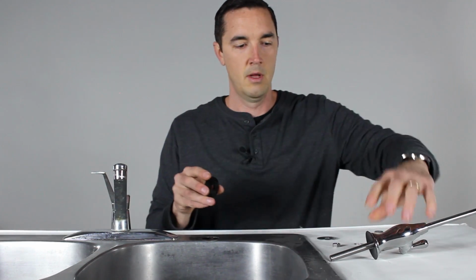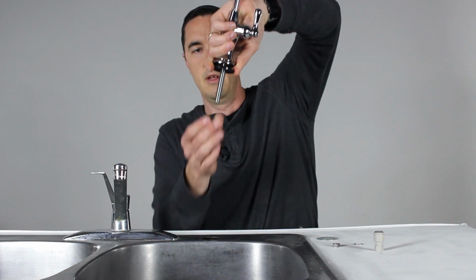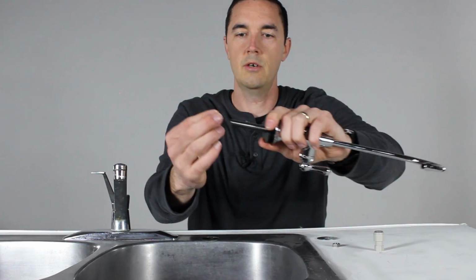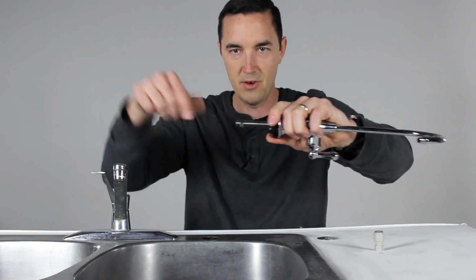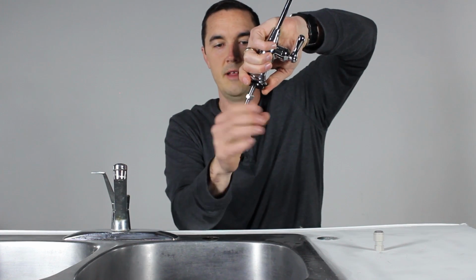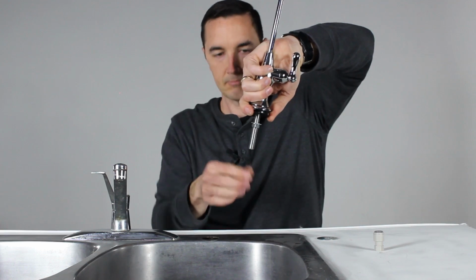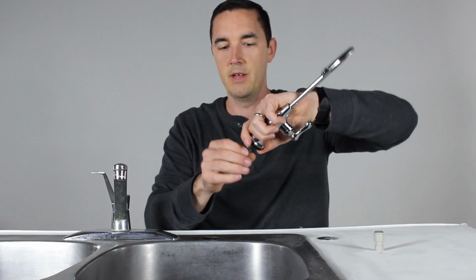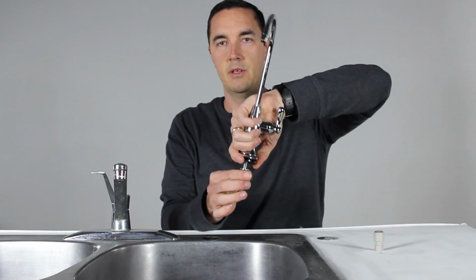This is a large hole, so if we're underneath the sink, we take that smaller diameter and push it up first, and that'll seat against the countertop just like that. Then you have a locking washer, goes on the stem next, and then the nut. And those are the pieces that'll fall down those cracks I mentioned. Okay, it's gonna go on really fast here. It'll take some time underneath as you continually twist it up that threaded neck there, the stem. Once those are good and tight, finger tight, and you got the faucet where you want it, use an adjustable wrench or just a normal wrench if you can, and tighten it down about another 1/4 to 1/2 turn so it's good and tight.